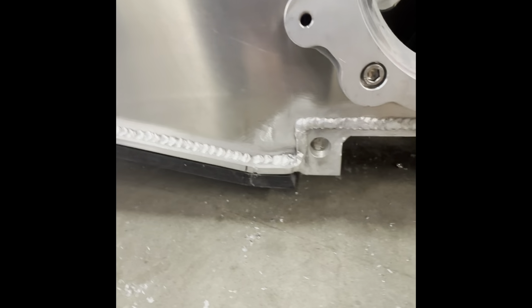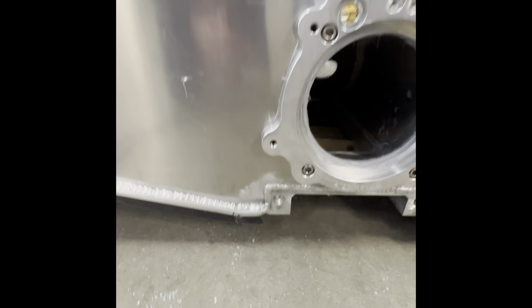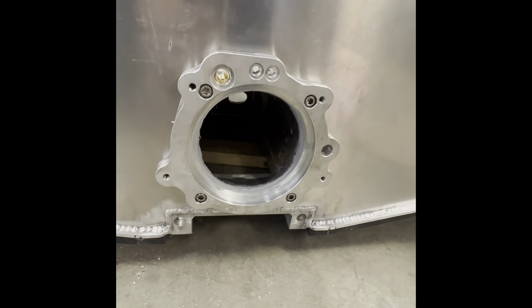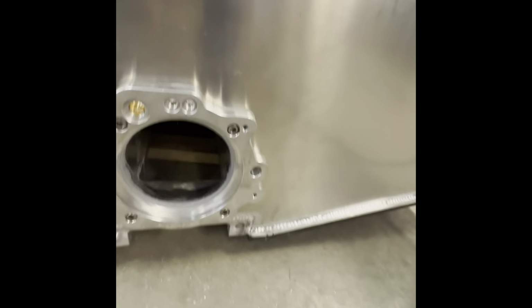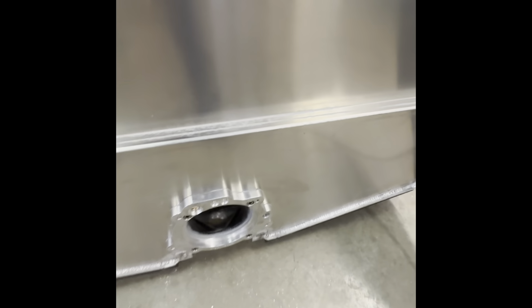I don't know if you've seen the last video, but if you don't put those in, the UHMW will rip off all the way up to about even 6 bolts. It'll rip right through that countersunk bolt. So you must put those in.